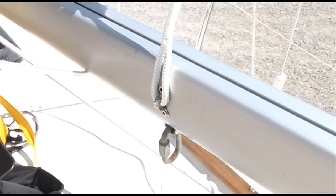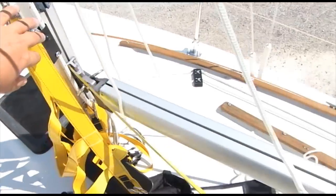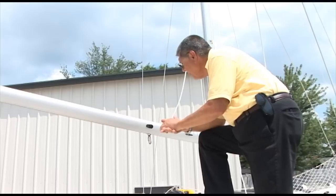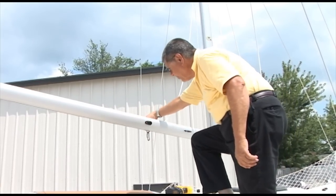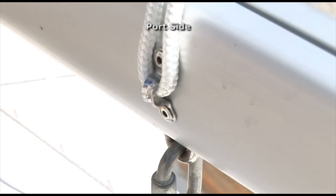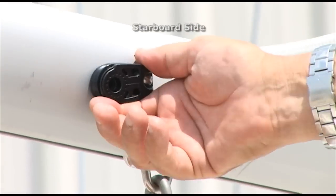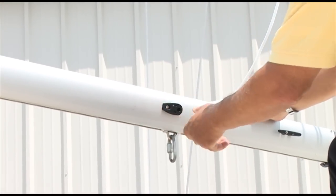For our boat, we're going to measure down 6 feet 6 inches for the boom cradle strap location, which will be on the starboard side of the boom. The order you do this hardware installation on the boom is: first a strap eye on this side — that's where the eye of the rope is affixed. Then you do the cheek block, which can face either forward or aft depending on whether you want your cleat to be forward or aft. The instructions go into that in detail.